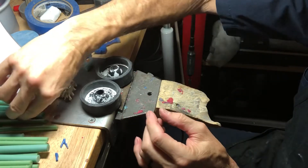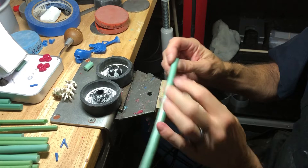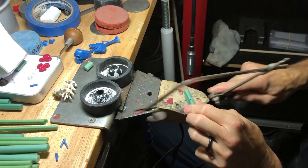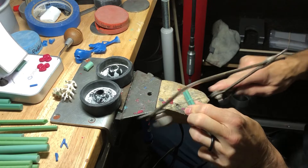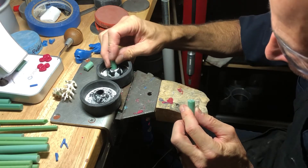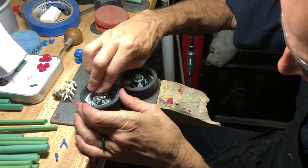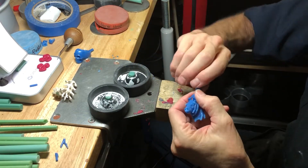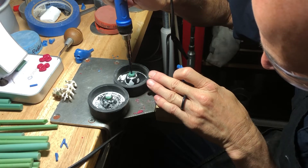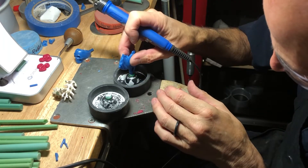What I'll include with the kits is about three-eighths inch sprue wax. I take a regular jeweler's saw and cut through it — if it's cold where you are it might crack, but here it's a little warm. I break that off and push it right down in there like that. I've got another one here already done. Push that in like that, twist it off, and push it right down into the center. It has a great sprue on there already.